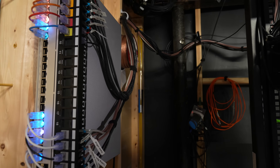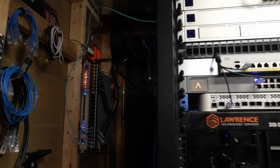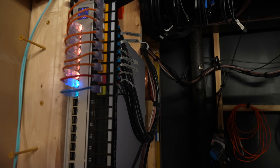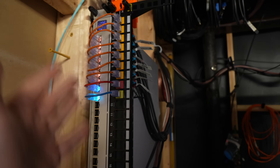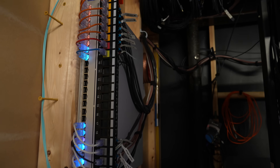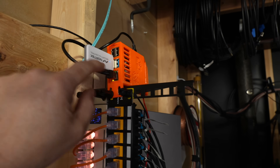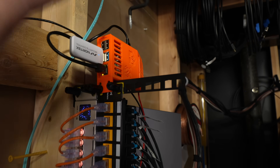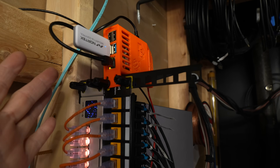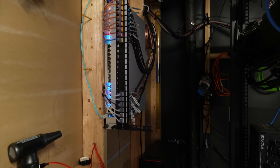Tucked away back here is my house and studio cabling. I didn't want it in a rack for convenience — this way I can simply run a new cable without figuring it out at the top of the rack. It's relatively well labeled because I label each run as I do them, so if I ever have to move things around I know exactly which cable goes where. This one cable here feeds the Home Assistant, which is sitting on top here. The Home Assistant just has a little PoE splitter — it's a Raspberry Pi 4. This dongle controls Zigbee and Z-Wave. I know people get upset that I'm not virtualizing it, but I like it being a separate dedicated box so that any maintenance on other servers never affects Home Assistant.